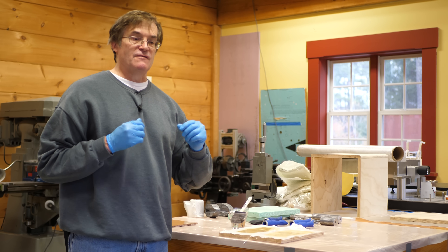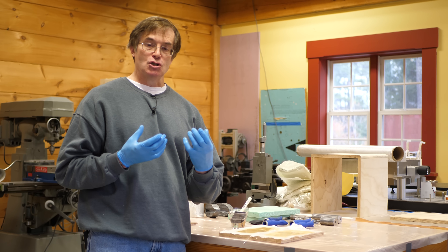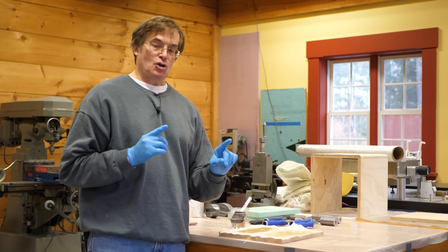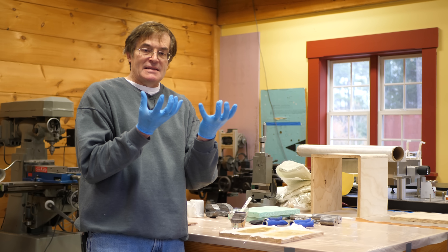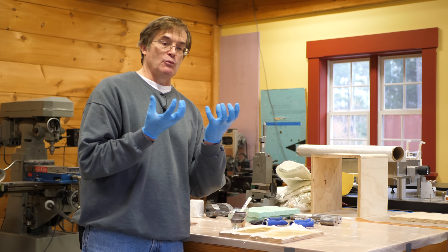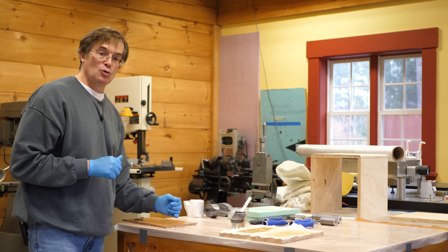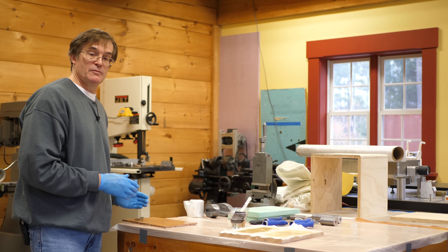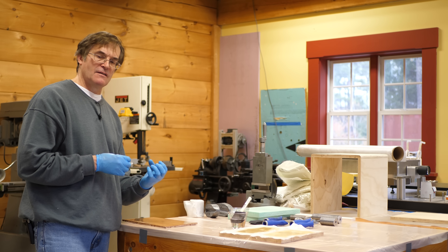In composite epoxy work, it's very important to take advantage of time. When the epoxy comes in two components, they're monomers, and when you put them together they polymerize. As they do, the mixture begins to thicken, then gel, and eventually you'll get to the point where it starts to get firm but tacky. When you no longer can move it around, and when you pull your finger away from the tacky surface and no longer pull any glue away, you still have a lot of raw monomer ends sticking up in the air. If you then take a second batch of epoxy and apply it, you're not going to slide the cloth around, and you've still got monomers you can covalently bond to and produce a very strong structure. Because if you take fully cured epoxy — which is fully polymerized — you can't really bond epoxy to epoxy chemically, only mechanically.